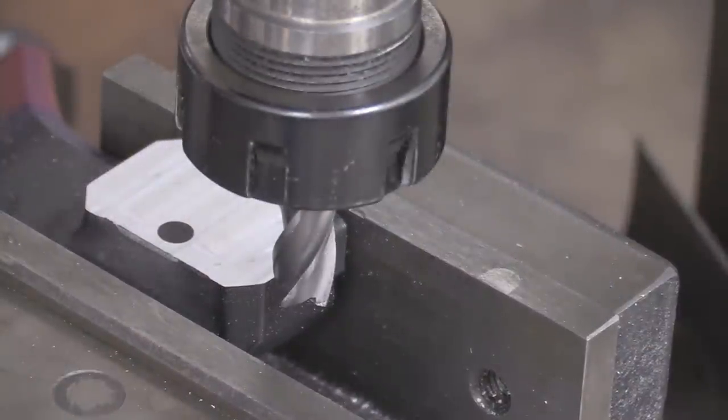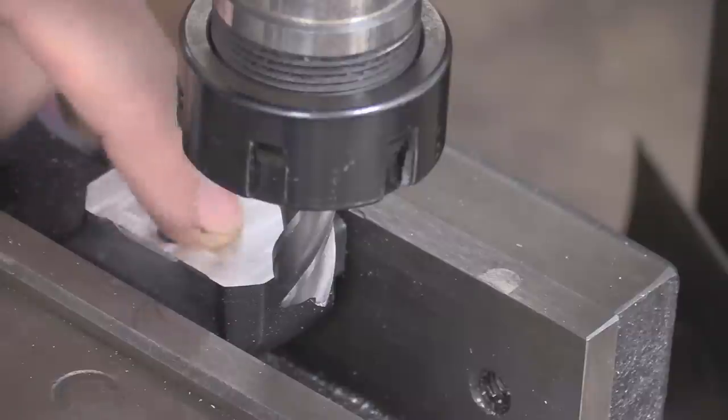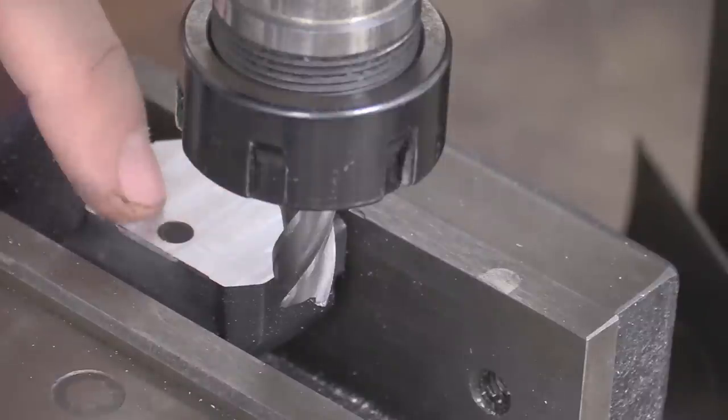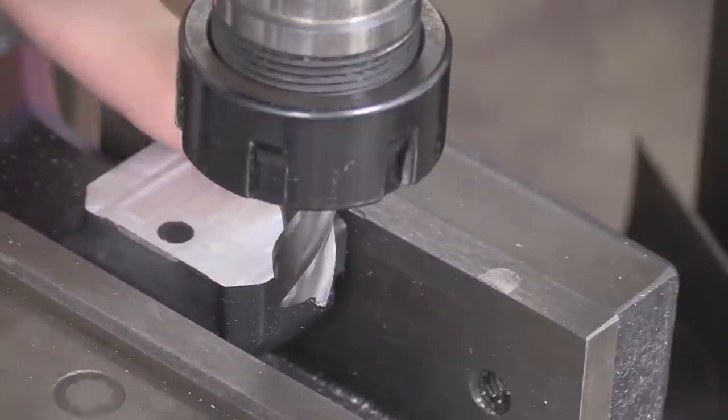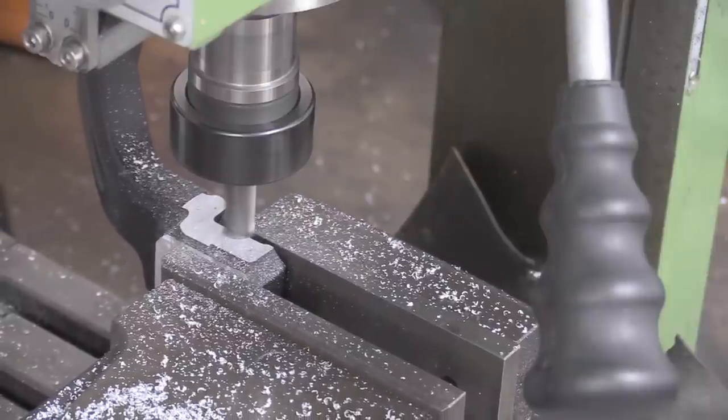There you can see that little black dot that's still got paint in it. That's where the ejection pin was, and that's, God, I don't know, 120, 150 microns, something like that. Where the ejection pin has pushed down to eject the part, it's just collapsed it ever so slightly. But that's pretty good going.